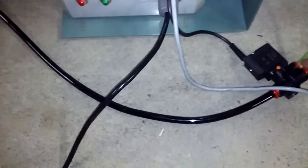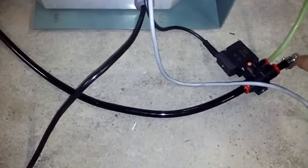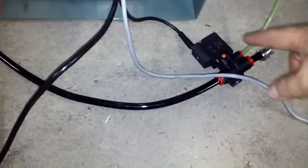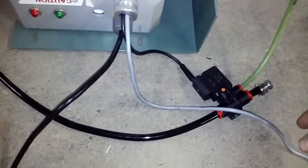It controls airflow through here and into an SMC pneumatic valve. This is a plug because it's actually a pass-through connector. If you look at the rails I'm providing, you could hook up dozens of these with different zones, but for us we only need one zone — just starting and stopping one box.